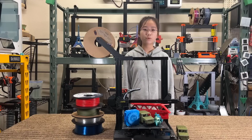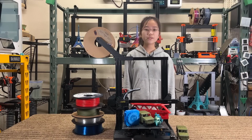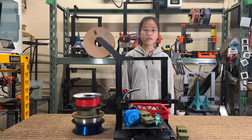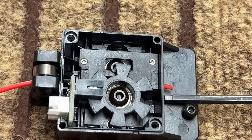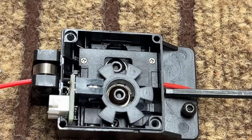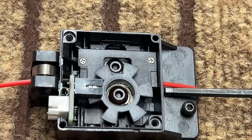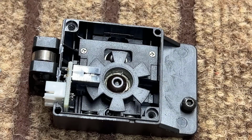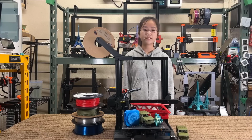The filament sensor works the same as the Big Tree Tech Smart Filament Sensor. A regular filament sensor is like a limit switch. When the filament is inserted, it presses the button inside and it thinks the filament is feeding normally, even if the filament is broken, and just leaves a piece inside the filament sensor. However, this smart sensor actually has rollers inside that keeps moving when the filament is feeding, so if the filament breaks, the rollers will stop rolling and will send the filament runout signal to pause the print, which works better but costs more than a regular filament sensor.